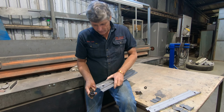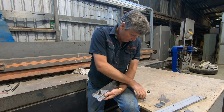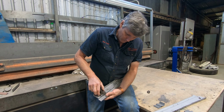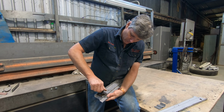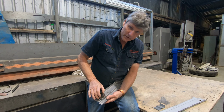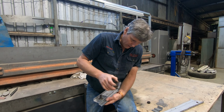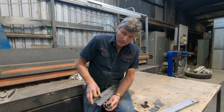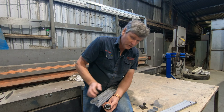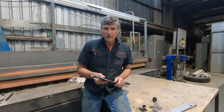So when I've put it together on this, I've gone through there on my flat piece of metal, dropped that on there, put a flat plate on the top, and then just run the nut down, pulled it up nice and tight with a couple of spanners, and voila, the job's done. We've got a factory looking pressing, just like that. And once again, very simple tool, and I made the whole thing in about 20 minutes, start to finish. So that's sort of the simple things you've got to be looking at all the time while you're shaping metal.